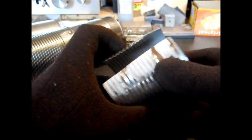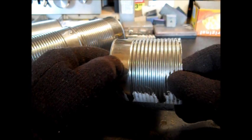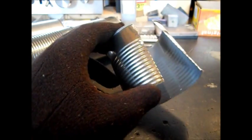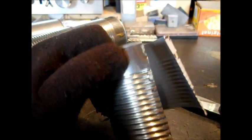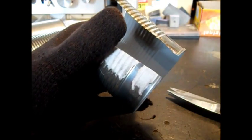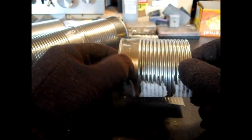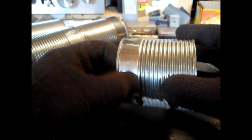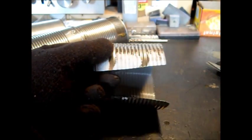We took another can the same size. We chopped off this much, which would have been this much here, and split it with the scissors. I did cut this with my scissors. When I get up here to this band, let's cut it with side cutters — cut right through it. You can do a lot of cutting on these cans with the scissors. You want to jab down here in a seam like this, jab with your scissors, cut it, then come back, find your groove and cut in it.